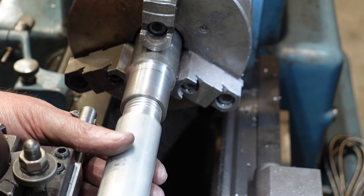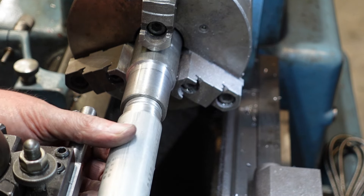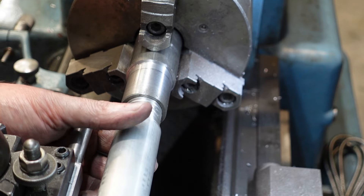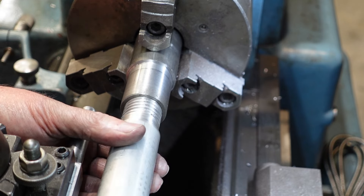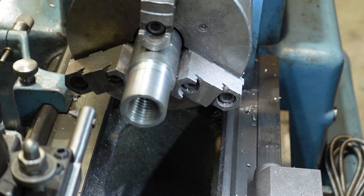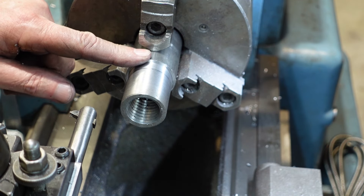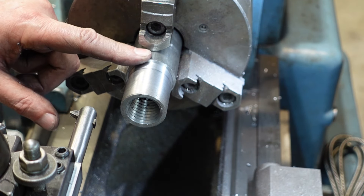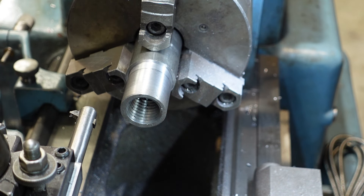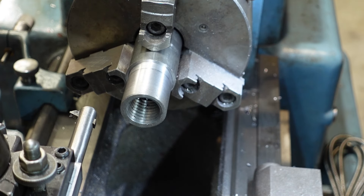As you can see, my test thread goes in and comes out nicely. It's a pity this is aluminium because it means it's a bit soft, but I'm pretty confident this will be good enough for the job - it's certainly a nice looking thread in there. All I need to do now is part that off and put it into the hand wheel, a couple of spots of braze and I'll be right. But I'm running out of daylight and I've got to go do meal preparation, so thanks for watching and we'll see you for the next one.